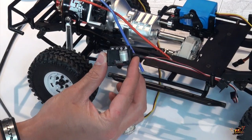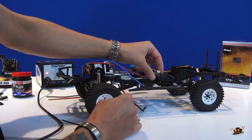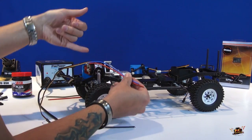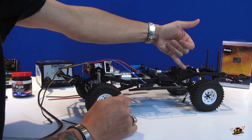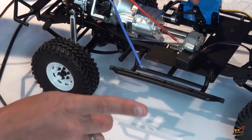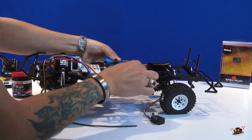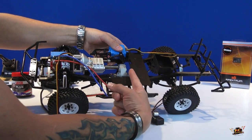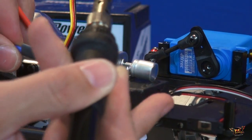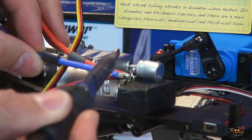The purpose of doing that is so when I go to solder it to the actual ESC itself, I'll have the ability to simply melt it in place — I already did the back of this as well. The motor is installed and I've switched the wires around. I'm actually going to move forward and try to place everything up front on the plate here. Keep in mind you still need a place for the battery — my choice is basically across the back. Remember when using heat shrink on ESCs: if the motor wires are attached, you have to have the heat shrink on the wire before you attach it to the ESC.